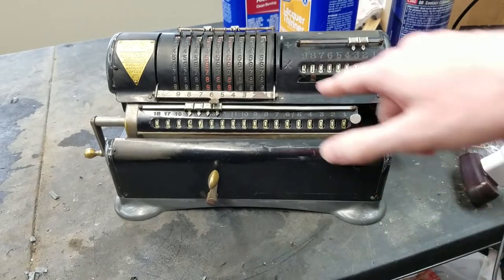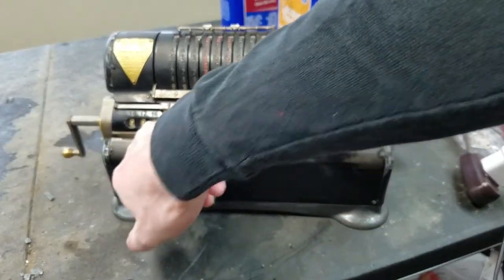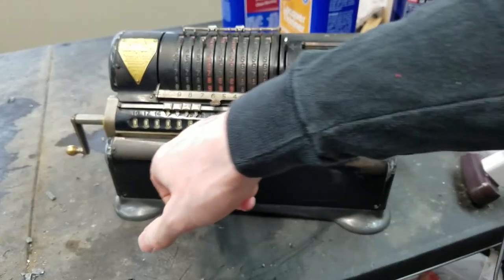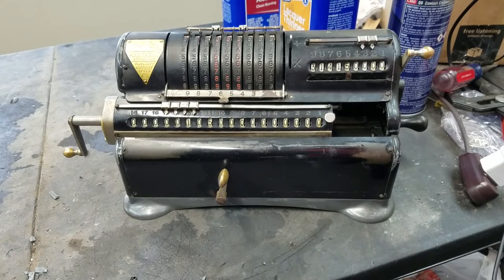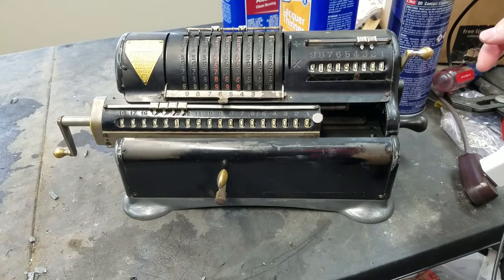Yeah, that's going to be more work, but you can see we're getting there. Then you just alternate — so now we're going to subtract, now we're going to add. That's too far — I wanted an extra turn, that's why I had to go back on that one. Let me subtract. One thing I'm not a fan of on these machines is there's no stop when you overflow. I guess a lot of the hand crank machines didn't have that. Like on the electric Monroes, when you held down the button and it hit overflow, it would physically stop the machine — there's a catch that stops it. Kind of nice to have. When you're going along, for me anyway, I usually end up starting the next revolution before I notice that the bell's rung. Then I have to finish that revolution and come back one. Because of that ratchet in there you can't go back in the middle of a revolution.